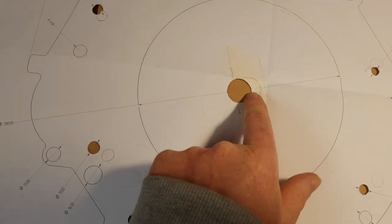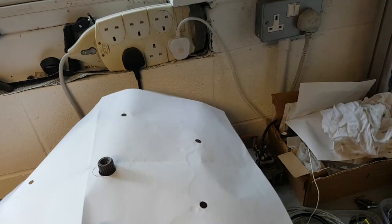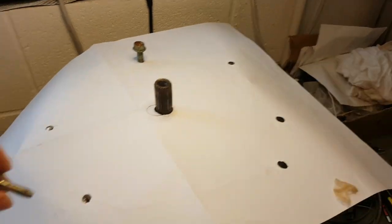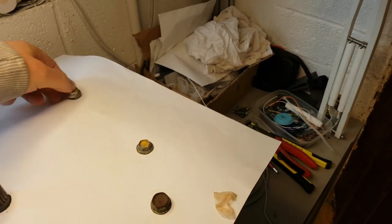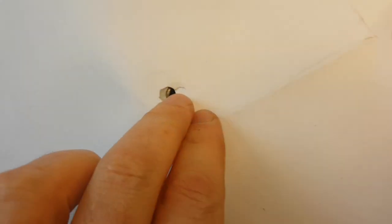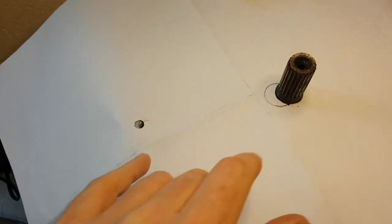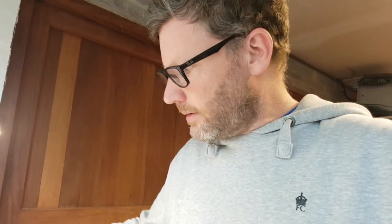I did make a mistake — I read it again and just cut out the holes. We bring it over, lay it on top, light on, and I can just line it up — one, two, three, four — and there was just one that was out. I was able to just amend the file by 10 mil — that's all it was. I think I'd measured it at 145 and it was actually 135. So I went into the step file, sent it back to them, and they should be cutting that out hopefully tonight. Get the adapter plate back and start putting it together.